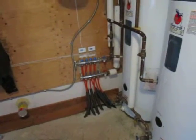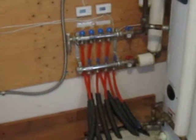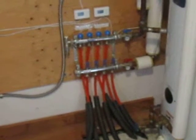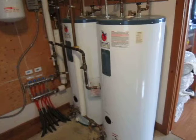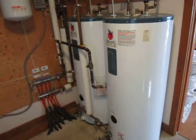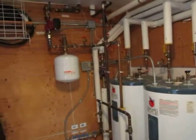Those orange pipes there are the pipes on the floor of the distribution system. Those are the PEX tubing and they go in four loops throughout the house. Those blue knobs are for balancing the system. And then moving back a little further, these big tanks here are my storage tanks for the heated solar water, and between these tanks and those orange pipes the heating water is moved. You can see the pipes in front that go up to the ceiling.